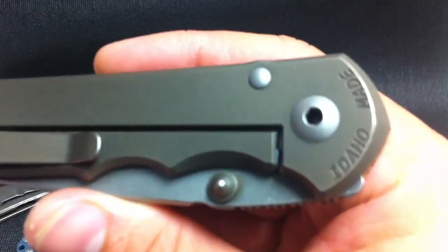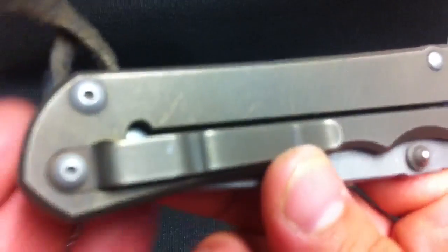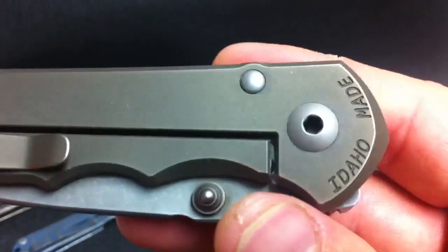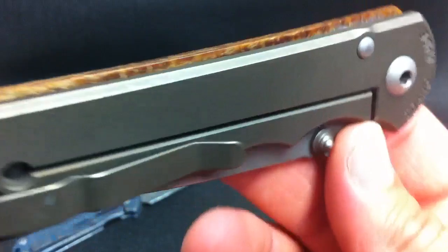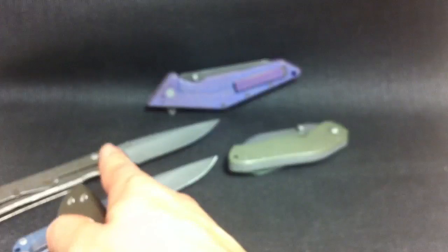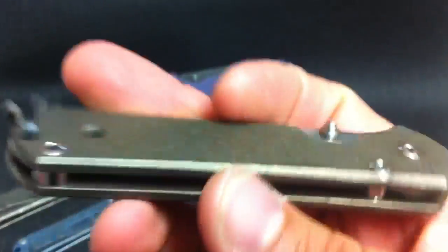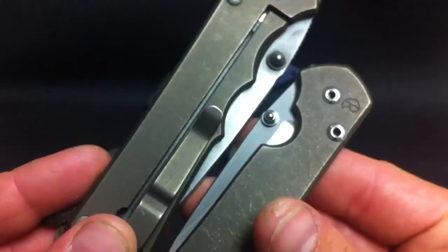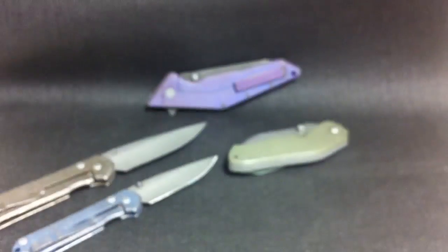You can go like this too — this is stone washed and anodized before anodizing. So you kind of get that Hinderer-type working finish when you anodize a Hinderer: blasted, stone washed, and then completely anodized. It was a little bit different than this — so this was bronze nuked completely like that, and then if I were to re-anodize this bronze, it would do like this. And if you anodize it all at once, it pretty much does that. So hopefully you can see a difference there. There is a difference in real life here — I need to upgrade my camera.